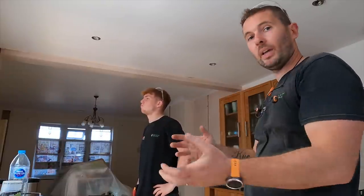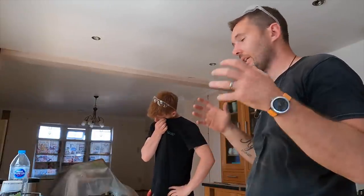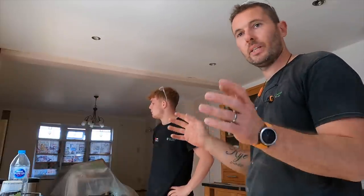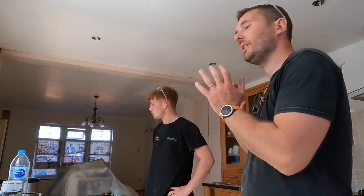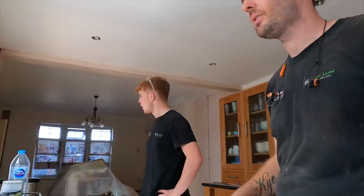As you've seen in the video, we're putting all the banding strap in, ready to hold everything. So it is a case of cables in, straight down, banding strap on, done. We'll be doing the plastering anyway, but if you weren't, it's ready for them. You can just crack on, go to your next job and come back for second fix.